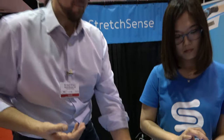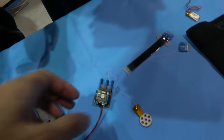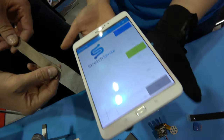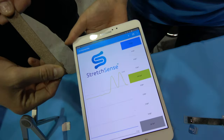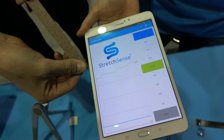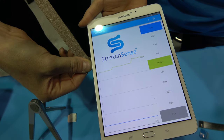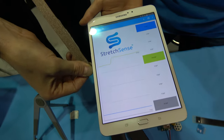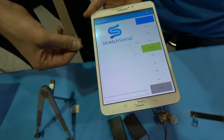The system uses algorithms in the circuit along with a Bluetooth low-energy connection. If you stretch it, you can see how it works — it acts like an elastic band connected to Bluetooth. It holds the reading really stable because capacitance is so reliant on area, thickness, and dielectric constants. It doesn't get affected so much by temperature as a resistance sensor would.